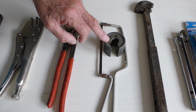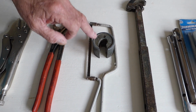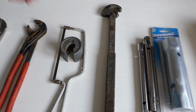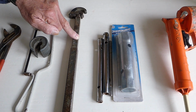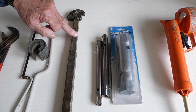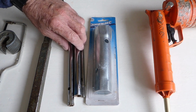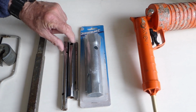And then 5th we've got here, I'll put them together because a saw is very, very cheap and the cutter's a little bit dearer, but you may never use this too often, whereas a junior hacksaw you could use for numerous other jobs. Okay, next, the basin spanner. Absolute master, really. That could have been further down the line, but I think in order that's where it is if you want to change taps or anything like that. Again, on the tap changing scenario, the next one in line is these. These are to undo monoblock mixer taps, and it's the only way you'll get them out under the sink.